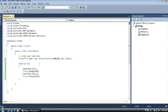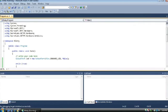And now let's run the program. Up at the top you see a play button. It says Start Debugging. You can also press F5. When we press this, our Netduino app will be deployed to our Netduino and start running automatically. It's pretty quick. Let's do it now. I'm going to press the button, and you see down here, it's deployed and it's rebooting, and now it's running.